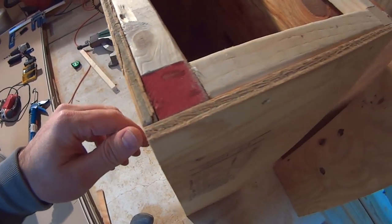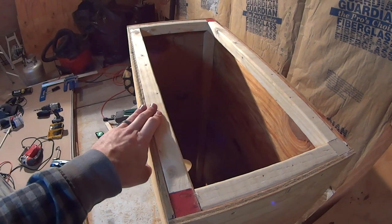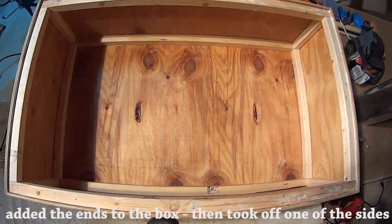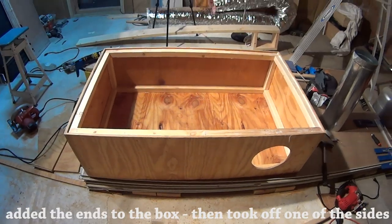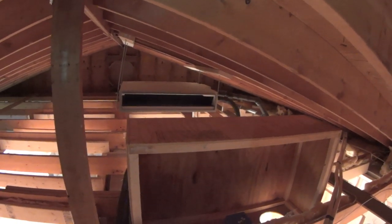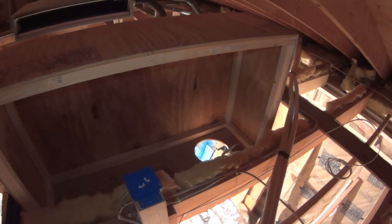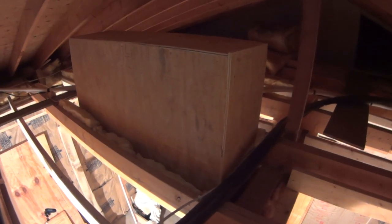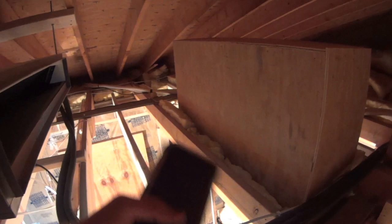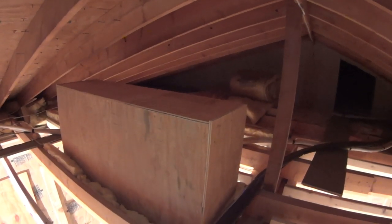I'll go ahead and caulk every single edge and make sure I get right where the plywood meets the 2x2 all around it on both ends. Then I can take off one of the sides and start filling it with the duct and a lot more fiberglass insulation. Up in the attic — it's a little dark — but that is the actual air exchanger, the heater/AC unit, and you can see the hole where the ductwork would go down into the studio. From the other side you can see how far the heat exchanger is: probably only about three feet. Coming out of the back or the top will both work, but I'm going with the top.